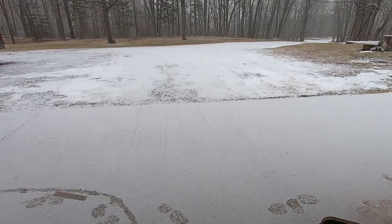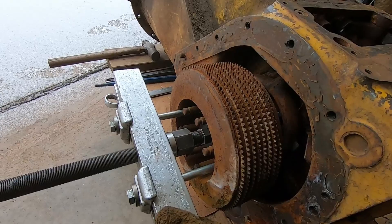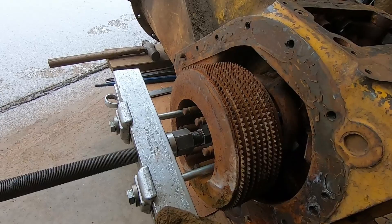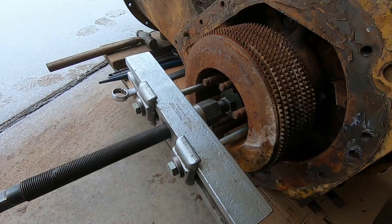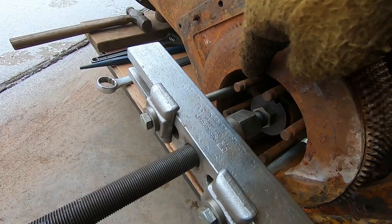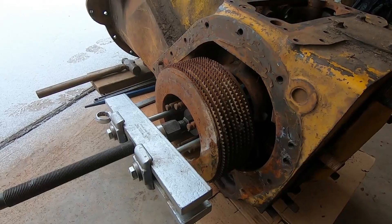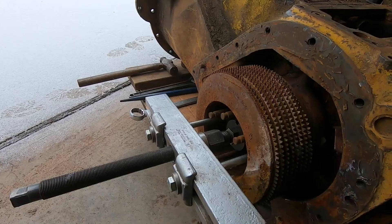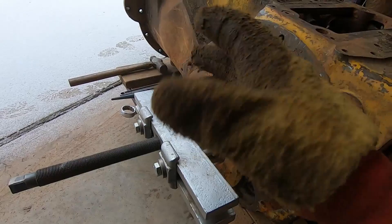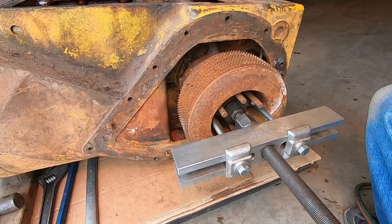The plan was to relocate outside for this next step, but literally five minutes ago Mother Nature saw fit to make it start snowing, so we'll work in the doorway — it'll be fine. Now we're ready for some heat. I've got the big screw puller on there; we're not going to use the hollow ram, just use it in its original state with no tension on it yet. I prefer not to heat with raging amounts of tension on things, so we'll apply heat first. I can roll this all around and get everywhere, then once the heat is on we'll crank this thing down. That might make it pop. If it doesn't, we'll let it sit and cool — there have been times where I put heat on a tapered press fit and it won't pop when it's hot, but after everything cools down it's mysteriously loose. That expansion and contraction does wonders. Let's start playing with some fire.